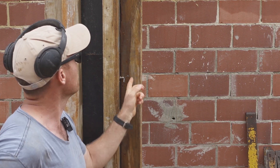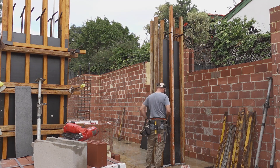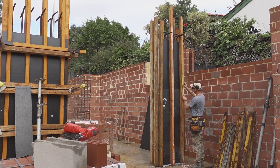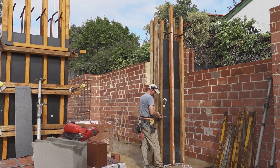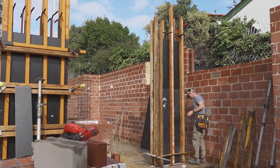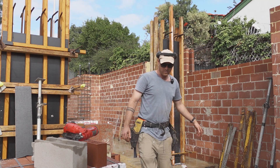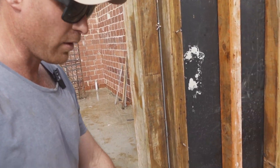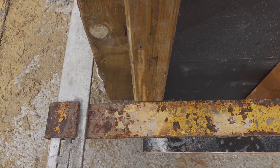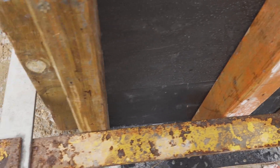That's it — if you need a bit more just put another one. I'll give you a little time lapse of me putting these clamps on. A common mistake with these column clamps is people start putting their wedges in and tightening everything before it's ready. So before you put your wedges in these clamps, just make sure there's no gaps on these timbers. If there are gaps and you put your wedges in and start tightening, your clamps aren't going to do up square.